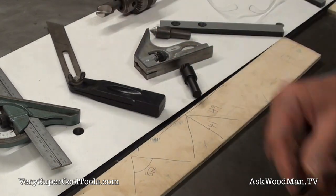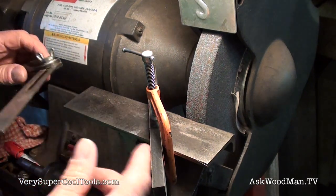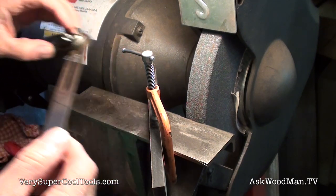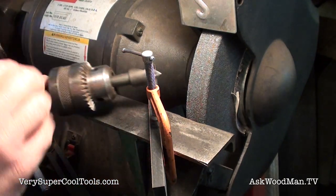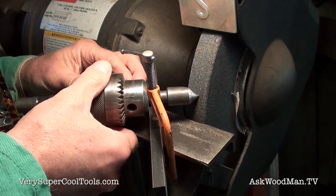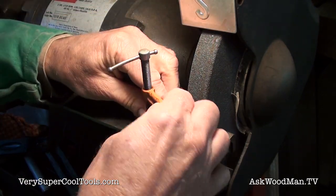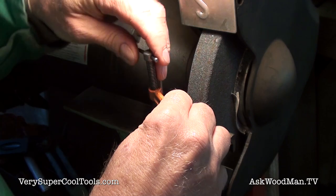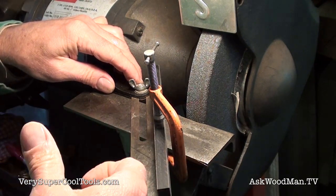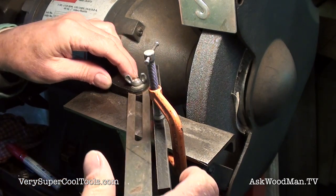Let's go out to the grinder and get at it. This is as easy as clamping on a little piece of scrap material — in this case I'm using a piece of that phenolic material — at 49 degrees. You just need to get the distance right so that when it's on here you're in the right position from the wheel. I need to move this over just a little bit, get it loose, come back in and check my angle again, then tighten her down.